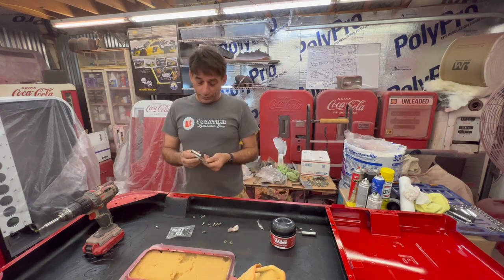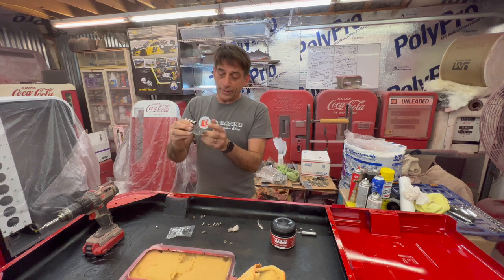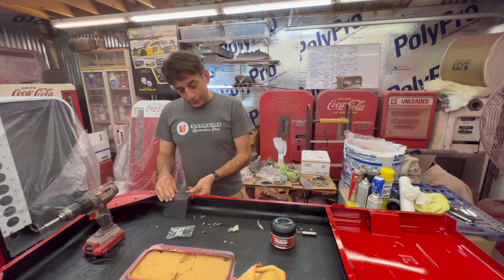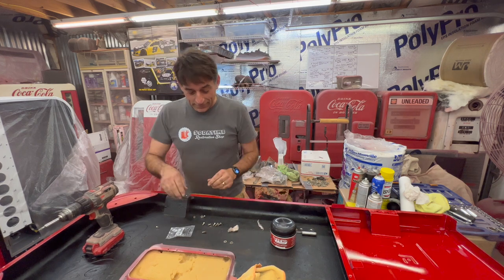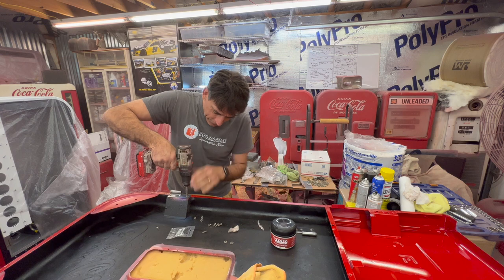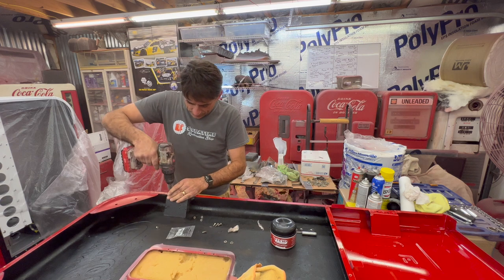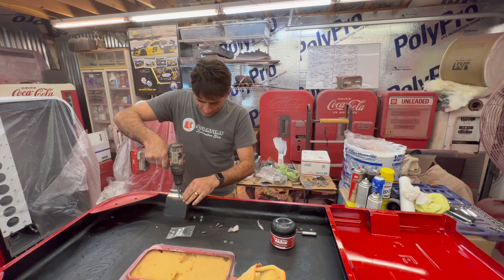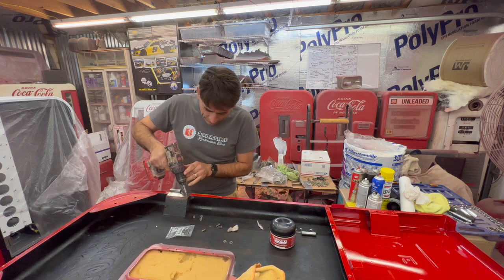There are two ways you can put these on — obviously if you just look at your door you can figure it out. You definitely want the slot where the pin comes in from the bottom. You don't want to put it on upside down, especially after you put the liner on — you'll be taking that one back off. These are 10-32 screws. Try to run them in there first, get everything kind of lined up, and go ahead and tighten it down.